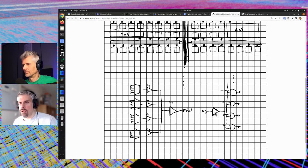For inputs from outside the chip going to the user modules, it's sort of like a clock distribution. There's one buffer that takes the signal from the vertical spine and sends it into a bunch of AND gates. The AND gates serve as buffers themselves, and the output of each AND gate goes to the module. This guarantees that every module when not enabled actually gets zero at its inputs — meaning if you have a reset signal, your block is held in reset when not enabled. Same for the clock — it's not toggling while your block is not enabled, so it doesn't burn power.